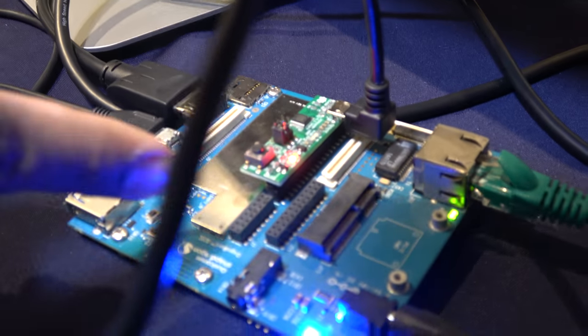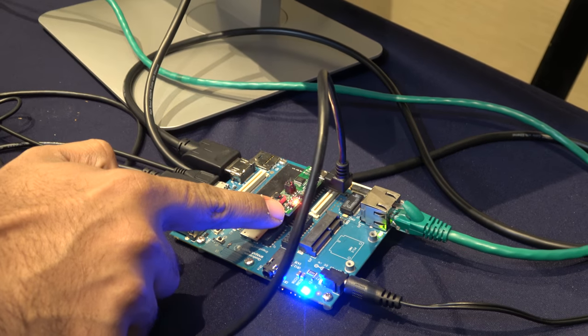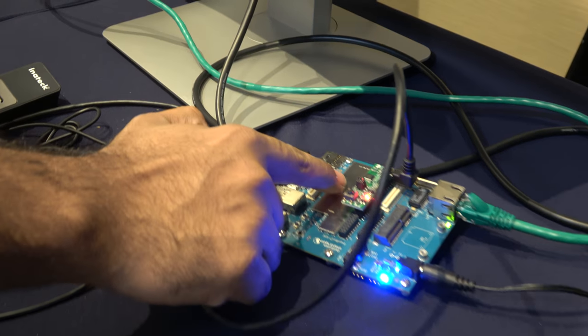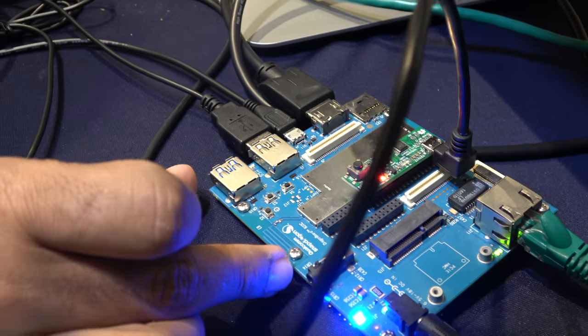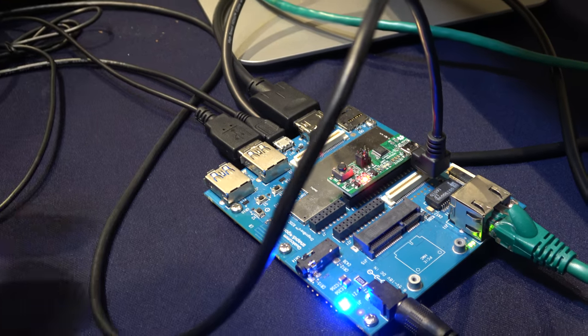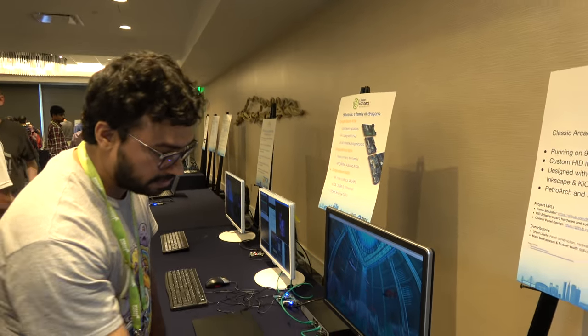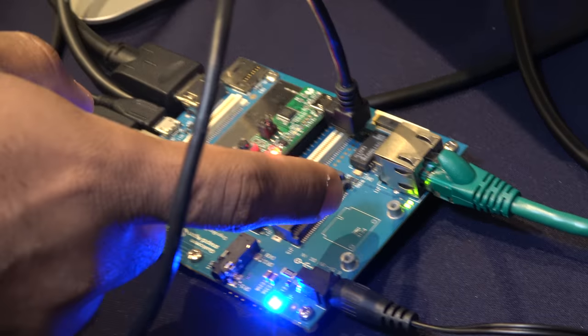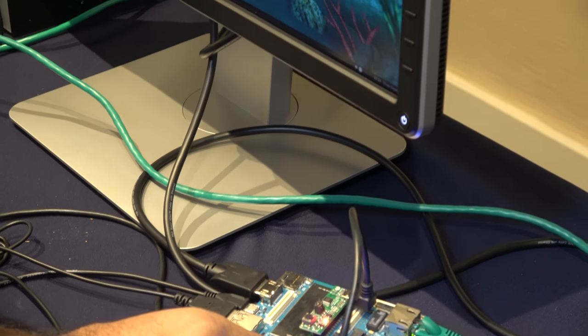And this is all merged upstream. Can we check the board a little bit? What's on the board right there? So this is just a little mezzanine to collect UART logs. The actual APQ 8096 is hidden underneath. This is a consumer edition form factor, but just double the size — similar to the 600, so it's an extended edition kind of. You've got additional ports, like an Ethernet port, and you can attach a PCI Express slot and stuff like that. This part of it is exactly like the 410C.